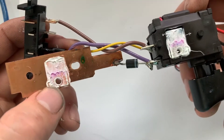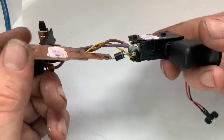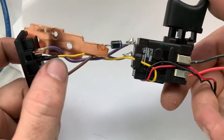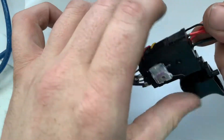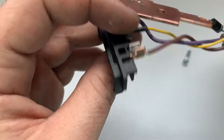There's a little bit of pink stuff in there — not sure what that's for. There's also some green goo, maybe something arced, I don't know. This is obviously the main switching MOSFET, which regulates how much power goes to the motor when you press the trigger. It's really impressive how compact this circuit is. This going to be a temperature sensing wire. These are the positive and negative from the battery, and this is the output. They actually ultrasonically welded these wires onto the tabs — they weren't soldered like the other connections. It's interesting that they soldered some parts but not others.